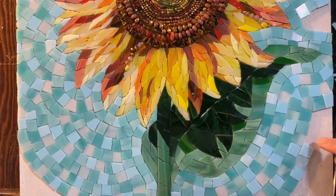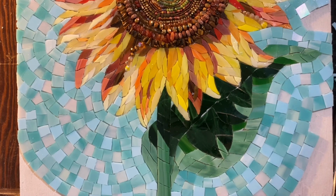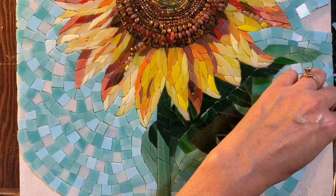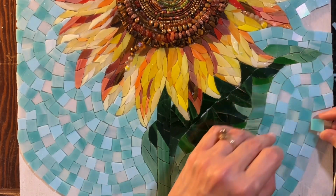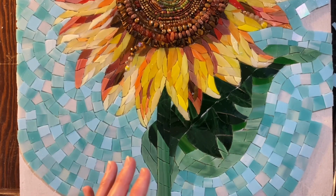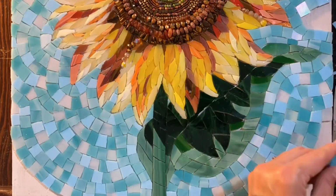Anyway, the other thing is that I do like to individually cut the pieces and place them from the strips because they are keystone somewhat, and the keystone varies. If I had a pile of squares, I would probably have to nip them down to fit, and it just seems faster if I'm going to cut them custom, starting with a basic rod and fitting the piece. I already know what I'm going to do before I start, and then I just follow the plan throughout for the best result.